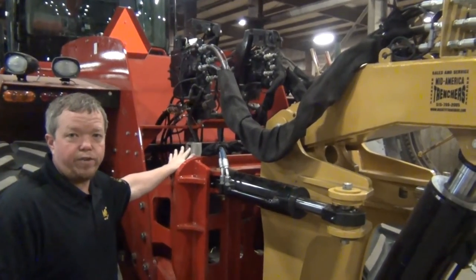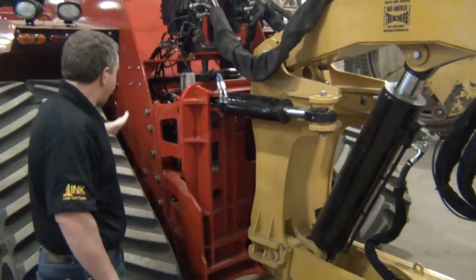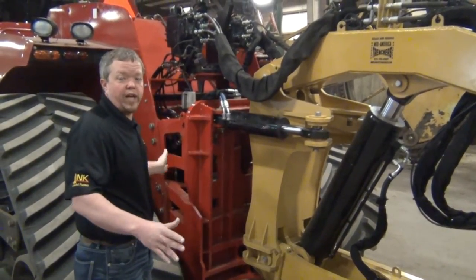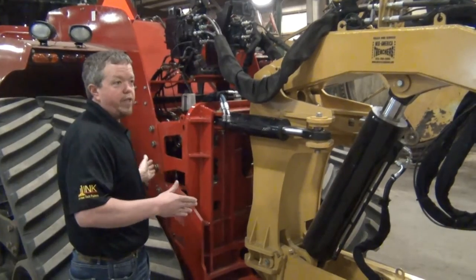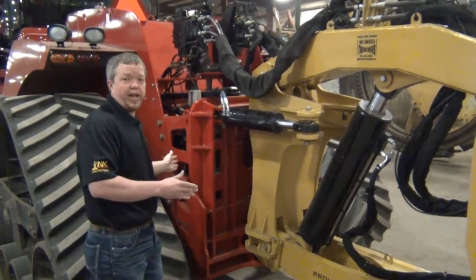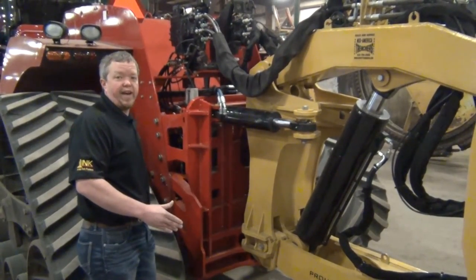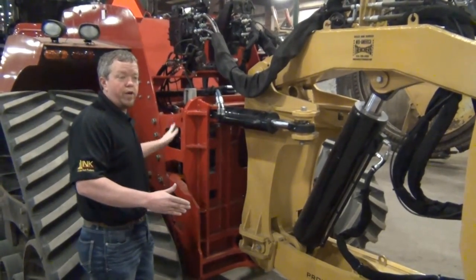This customer also pulls an anhydrous bar with this tractor. When he gets ready for that time of year, he can walk up, set the plow on a rack, undo the bolts down the side, pull the pin on the drawbar, unhook the quick remotes, drive away, slide the factory drawbar right back in, and go back to use for a second application tractor. There are a lot of misnomers around a mounted plow about how long it takes to take the plow off. If it's done correctly and well thought out for the engineering as you go into it, you can do this in a matter of hours. These tractors are too expensive to have as a one-application unit most of the time, which is why people sometimes wonder about mounted plows.